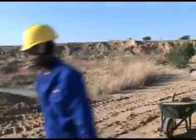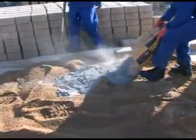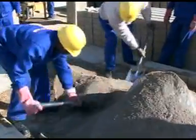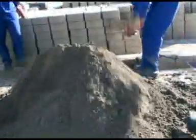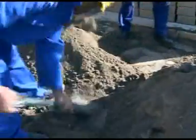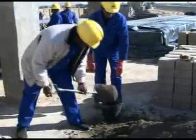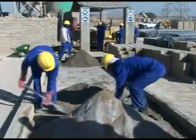After sieving, the soil and cement are mixed together. The cement content will depend on the required strength of the block. Hydroform recommends between 5 to 8 percent cement by volume of the soil. Mixing can be done by hand: first the soil and cement are dry mixed together until an even colour is achieved. After dry mixing, water is gradually added by using a watering can and then remixed thoroughly. Water must never be poured on as lumps will form and the cement can be washed out. Always sprinkle the water onto the mix. The mix is normally mixed twice after the water is added. When mixing by hand, it is important to have two mixes continuously being prepared at the same time, to ensure that there is always enough mix for block making.